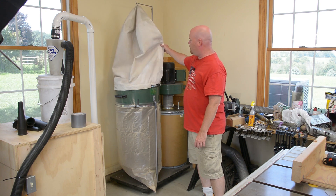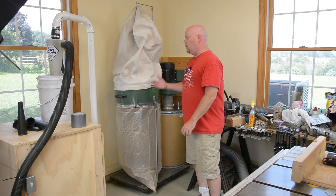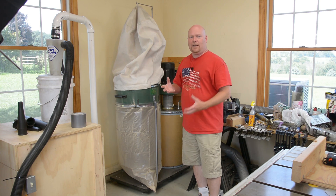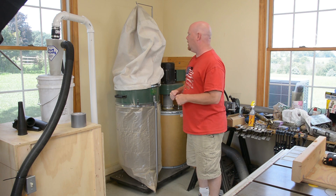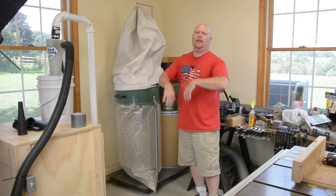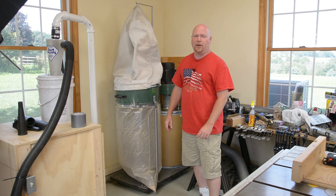The other place where they cheaped out is this bag. Bags in general are awful on dust collection systems — they have very low surface area for the amount of air you're trying to move. Harbor Freight has provided a 5-micron bag, which means it filters out particles bigger than 5 microns. That means all the really dangerous stuff — the 5-micron and smaller particles, the ones you really want to collect because they're the ones that get stuck in your lungs — they go right through this bag. Less than ideal from a health and safety perspective. From an airflow perspective it's just the opposite: big holes in the bag means lots of airflow. Either way, replacing this bag with a pleated paper filter would be a huge upgrade, both in collection efficiency and airflow. That's something I'll probably do one of these days.